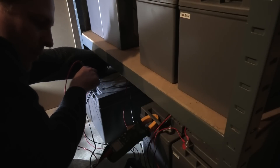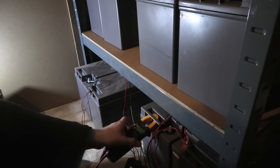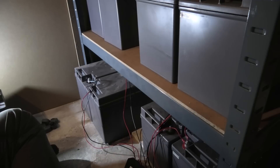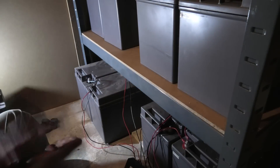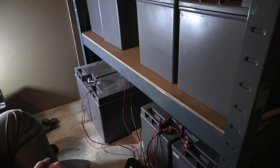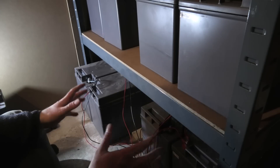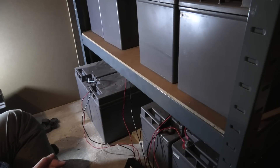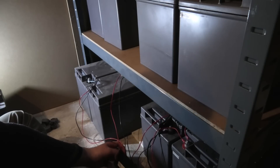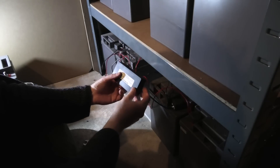This one is 11.15 and this one is 11.24, so it's not as if they're way out of balance but they're very low. These batteries are rather hot so they have been heating up. I have a suspicion that my battery bank here might be done for - these are from 2006, so the batteries are about 15 years old. There's probably not much to do anymore, but let's just hook this up and see if it makes any difference.